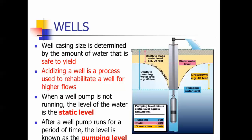When the pump is not pumping, the water sits at a static water level — there's no movement. When you kick the pump on, that is called the pumping level. The difference between the pumping and the static water level is called drawdown. There's a question on the test: what is the water level called when the pump is pumping? A lot of people mark drawdown, but drawdown is the difference between the pumping level and the static level.